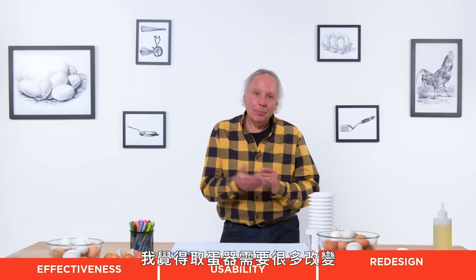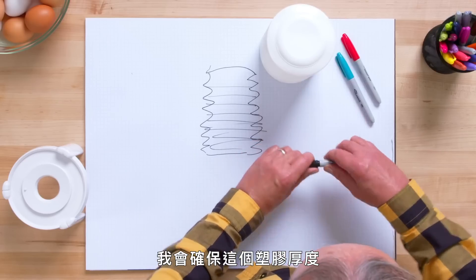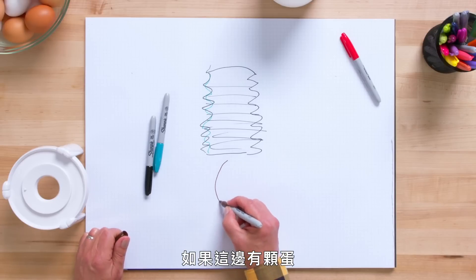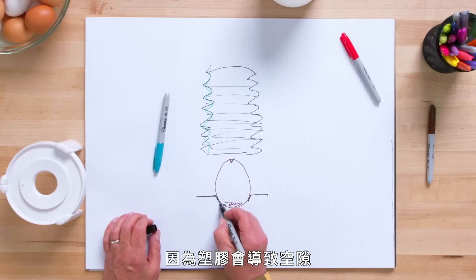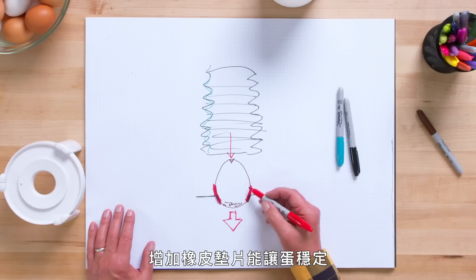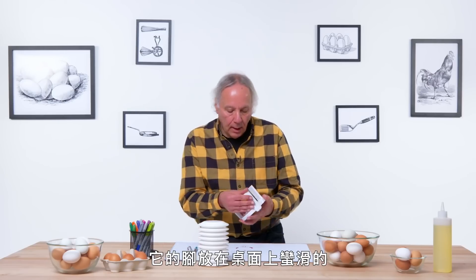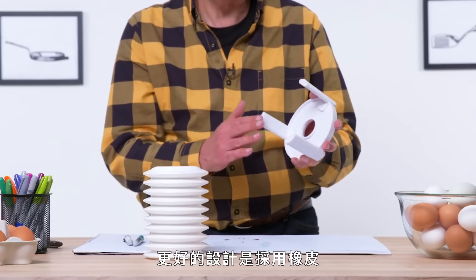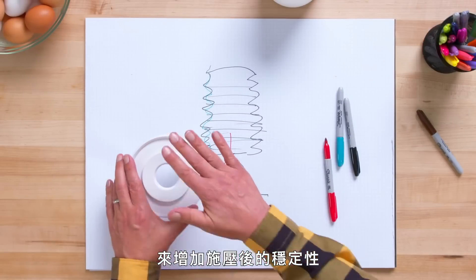In terms of a redesign, the extractor needs a lot of work. I would take this corrugated shape and make sure the wall thickness of the plastic is thin enough so that it doesn't have so much tension when you press it down. Also, if you have an egg here, what we have is hard plastic, but the egg easily goes out of whack and this hard plastic creates air gaps. Adding a rubber gasket, which helps to cradle the egg, can keep the shell in place as the egg is ejected. The device itself is rather large. These feet are a bit slippery on a countertop — you'd want to stabilize this, especially with the amount of force you may have to exert. Better yet would be some rubber feet. A three-legged stool like this is a little unstable — I would give this four or even five legs to increase stability when pressure is applied.